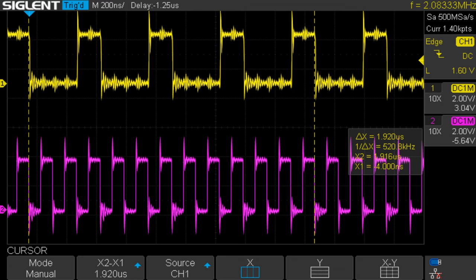So what we're looking at is M1 falls on the rising edge of the phi clock, and the very next edge, which is the first falling edge after the M1 signal goes active, we see the memory request going active, okay? And we see it stays active for, what is this, 2.5 full phi periods.